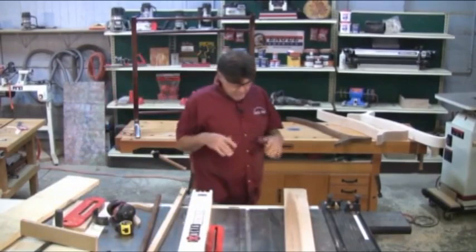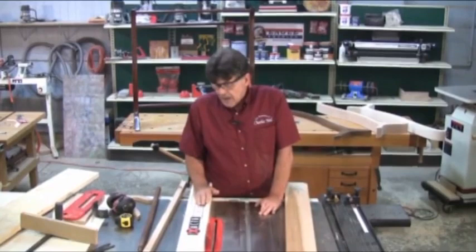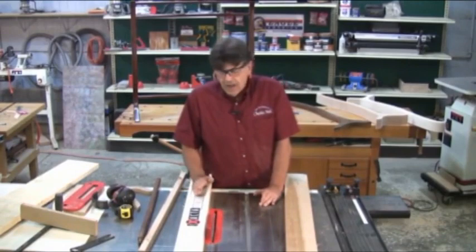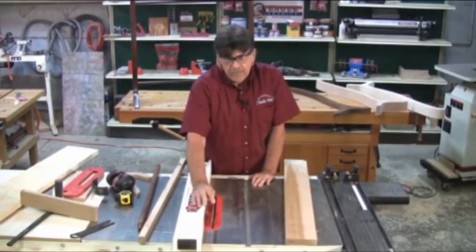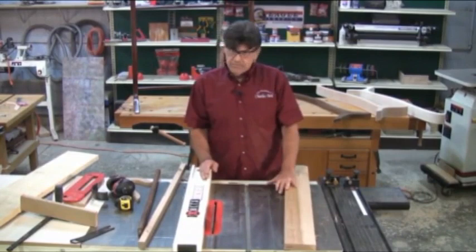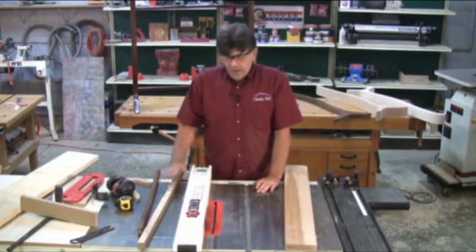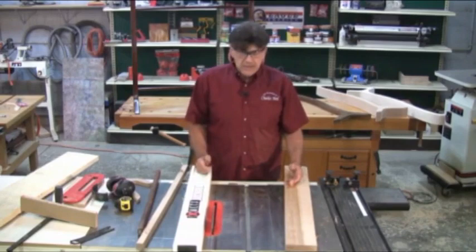And that said, if you're not aware, and I feel sure you are, when you cut something, one of the biggest mistakes I see made is when you're using a wider piece of wood and you want something that's kind of thin or narrow, guys just rip it. And you see it come off the table saw and you're going to see it do this or try to pinch. Now, pinching, that's where a good splitter, riving knife is a really important thing to have for safety. So what I always do, again, goes back to my little saying, sneak up on it. I never rip to width, particularly on something small, right out of the gate. Because if it moves, what do I do then? So what I always do is I always overcut, then I come back and ease in to the final cut. Makes sense and it works.